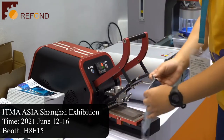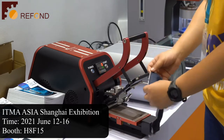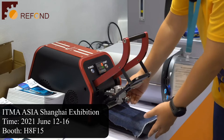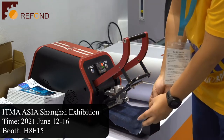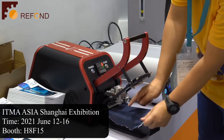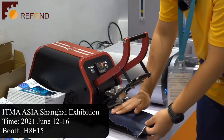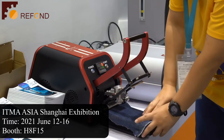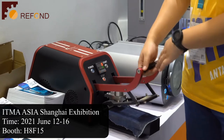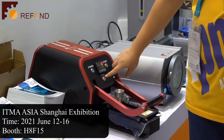This is for loading the samples. You just hold the two sides of the specimen, put it inside, and then rotate the knob here. If your sample is elastic, you can pull on the front side of the specimen to stretch it out. Or if your sample is not elastic, you can just rub it gently to flatten the sample. This is our patented push-to-lock clamping system — it is very easy to lock the specimen in place, and then you can start the test.